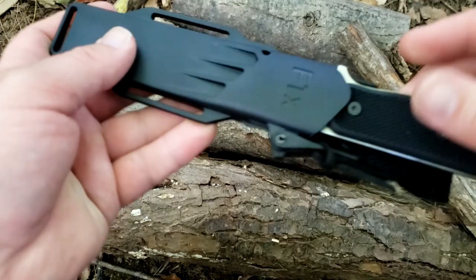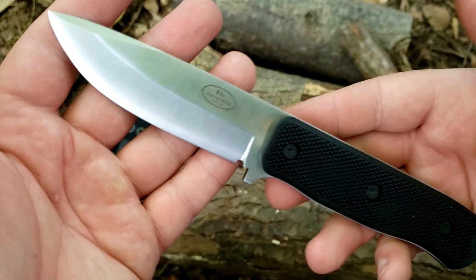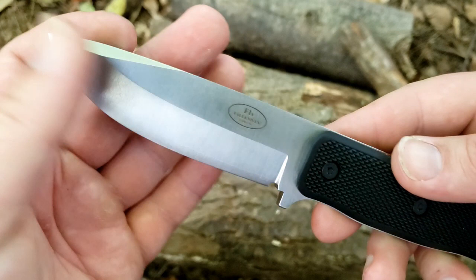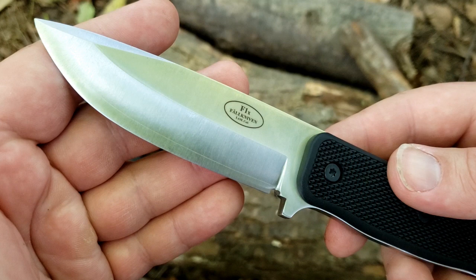Let's stick to the knife itself, beginning with this blade. We've got a very, very heavy-duty blade — five-sixteenths of an inch thick, convex grind, cobalt laminated steel. What we've got here is a harder cobalt steel that makes up the cutting edge, and then a softer stainless steel making up the rest of the blade. Again, designed to be tough and durable. And by the way, it looks kind of cool too — very, very purpose-built, heavy-duty type of blade.